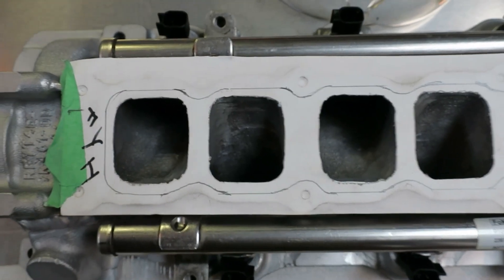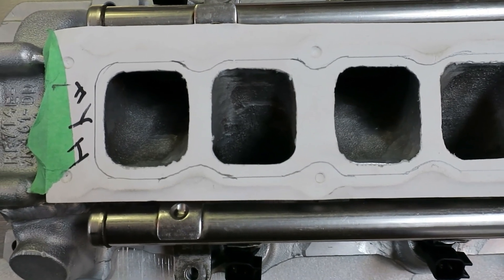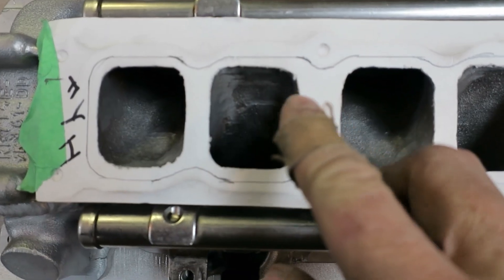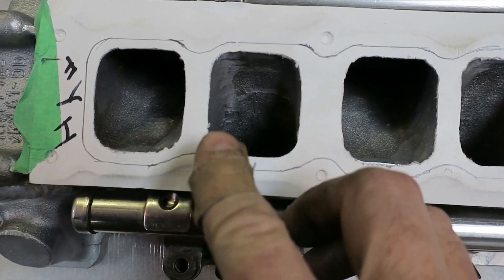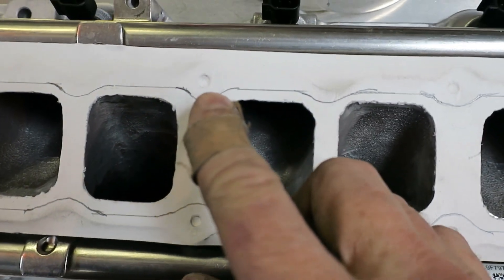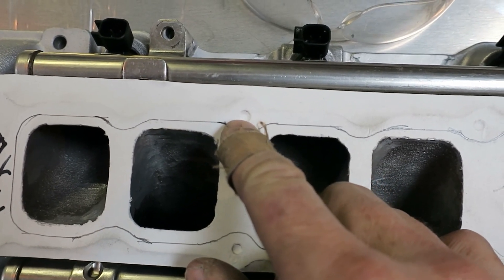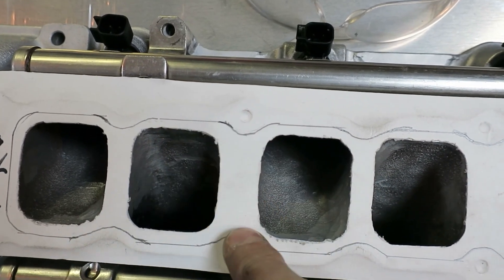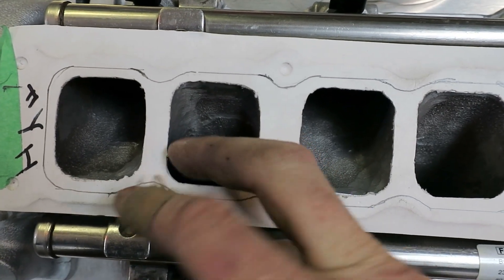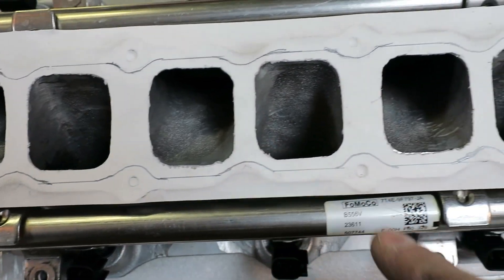Just making this paper template. I want to put an O-ring in the base of the plenum's base plate. The pressurized side needs to be sealed from the atmosphere, but it doesn't need to be sealed between the ports. As you can see, I've traced this paper template — it gets close in some spots to the bolt holes and also the space between the casting and the port. The wall is only three-eighths thick and I've got to cut a three-sixteenth-inch groove through there for the O-ring.